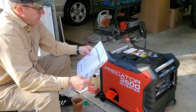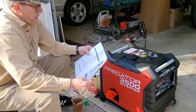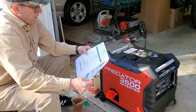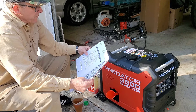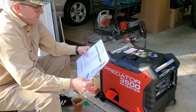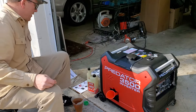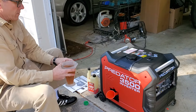This is a horizontal single-cylinder overhead valve air-cooled engine. It requires at least 87 octane fuel, can run at least 11 hours on 25% load, and only 57 decibels at 23 feet away at 25% load — so it's quite quiet. Pretty handy little item. Excited to have something like this because you never know when you might need it. Anyway, let's put in our 20 ounces of 10W30 oil.